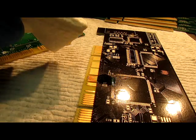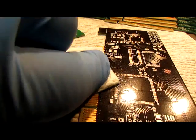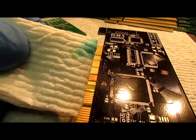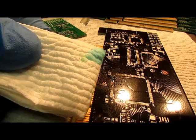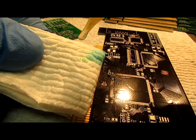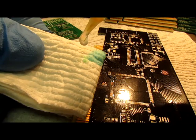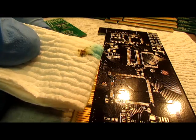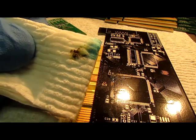Now I'll do the same thing — I'm going to blot the test area with a piece of paper towel. You can see there's pretty heavy copper staining there, but watch what happens when I put some stannous chloride test solution on the area where the acid contacted the gold fingers. You see that brown stain? That verifies that we have gold going into solution.